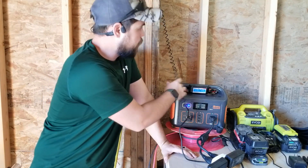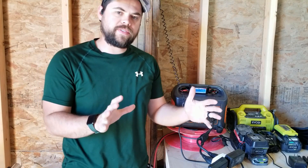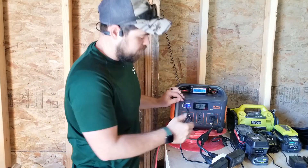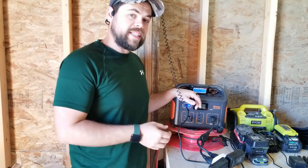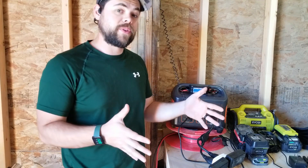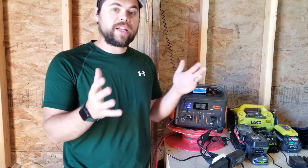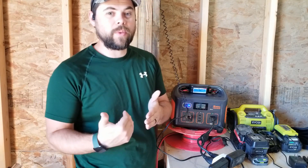I use it to run the shop lights and recharge batteries — it's great for that. It's also good for running a small fan; an average fan uses about 50 to 80 watts, so this could run it for six to ten hours non-stop, or reach a standstill if 60 watts of solar is connected. It's great for running a TV, a CPAP machine, or a DC fridge. It can run a DC fridge for up to about 24 hours depending on size, since a DC fridge only draws about 50 watts but cycles roughly 20 minutes per hour, consuming maybe 20 to 30 watt-hours.